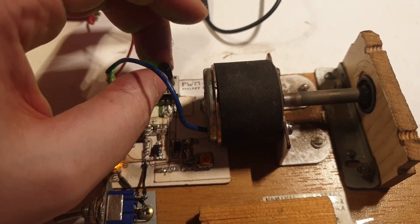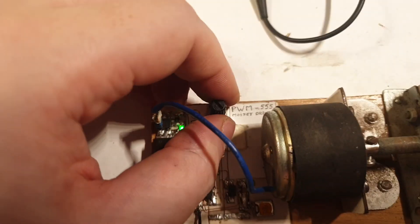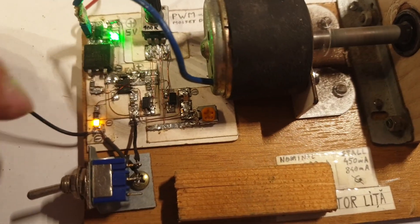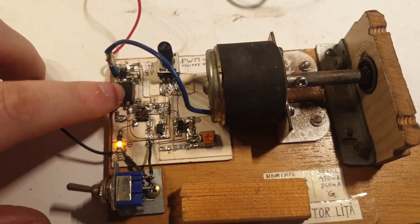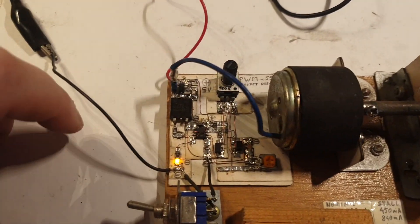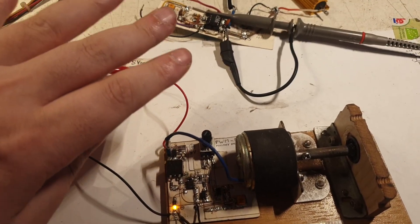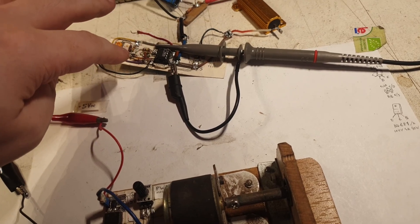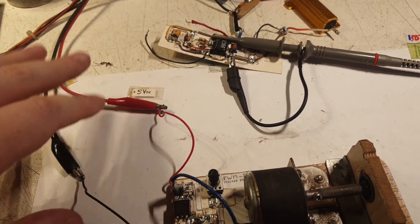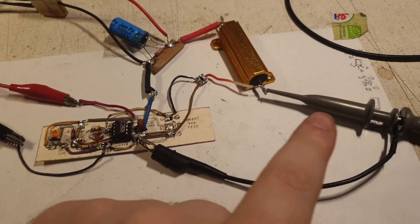This is low speed here. If I increase it — this green LED at minimum is dimmed, and when I increase it to maximum it's at its brightest. So this is the 555 PWM in action. In my last two videos someone suggested I use a 555 PWM, which I actually have, and I can borrow this board or make another one. But the idea is that it really doesn't matter how close to zero or 99% I get — what matters is that it's doing some PWMing when I turn the knob from minimum to maximum.